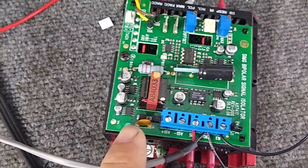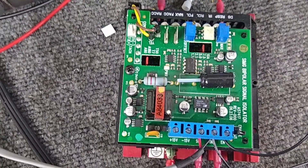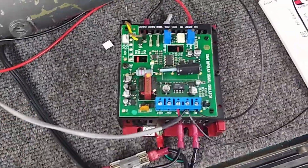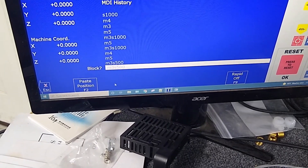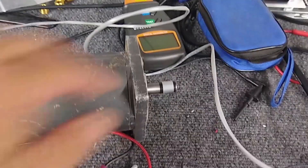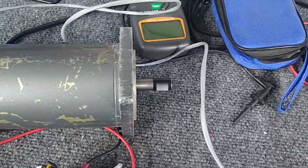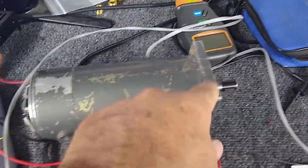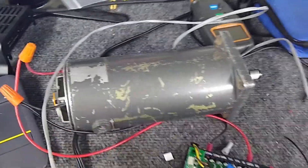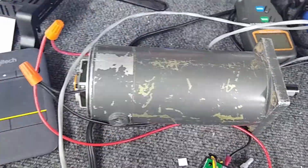There are a couple of other jumpers underneath the board, so take the time to read all of that and set it up correctly. Running M3 S500 — there's S500. I'm having a hard time stalling it grabbing it by that black tape. I had a four-brush motor and I could grab the shaft and stop it, so four-brush motors don't seem to work with the KBMG-212D. The two-brush motor with two brush holders — that works.